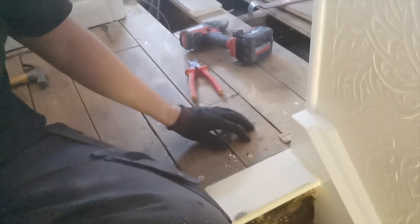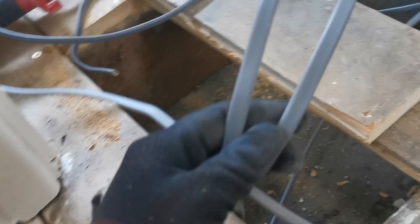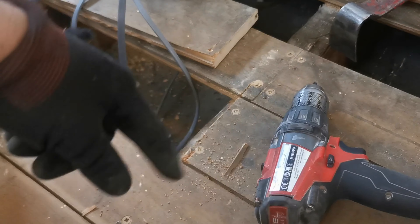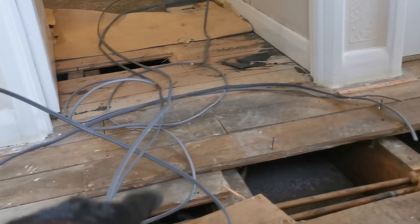Just a quick update — we've got all the cables that we need to bring upstairs up the riser in the kitchen. We're actually going to bring the cables for the light switches straight up through this bar here. The cables going up to this switch I've brought out to the side: you've got the two two-wayers, the feed for the upstairs light, and another cable going to the kitchen light from downstairs. Here we've got the two legs for the upstairs socket, a leg for the boiler, and another twin-and-earth going to that light there — long enough to drill in and send down.